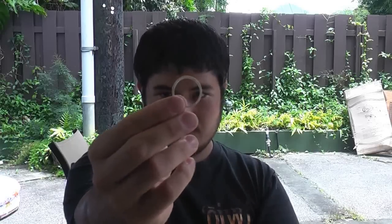SDR is a rating that bases the pipes on pressure rather than on wall thickness. Because this wall is so thick for such a small pipe, the pressure rating is very high. Whereas if you were to make a Schedule 40 pipe that was, say, 8 inches in diameter, the pressure rating is very low because the wall is so thin. Now SDR — this is SDR 21, 3/4 inch — the rating is based on pressure. SDR 21 pipes fit certain pressure ratings, so the smaller pipes have very thin walls and the larger pipes have very thick walls.